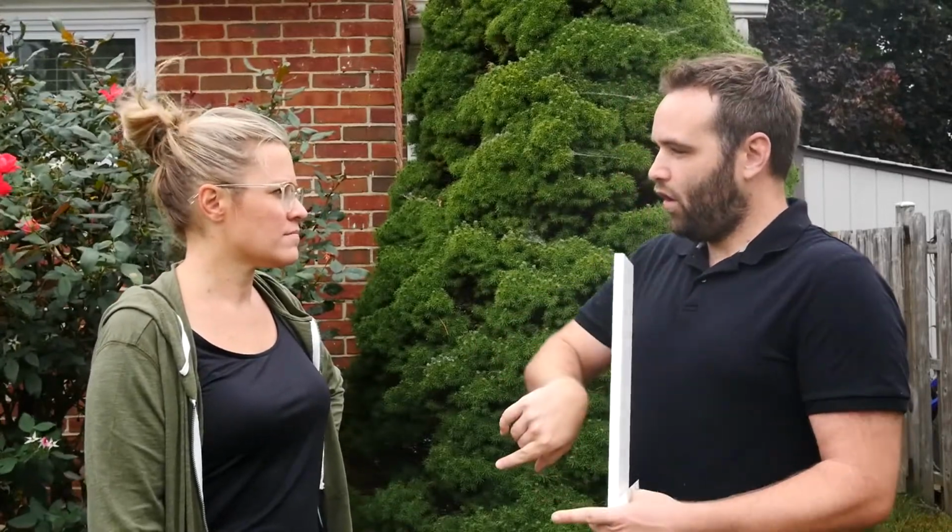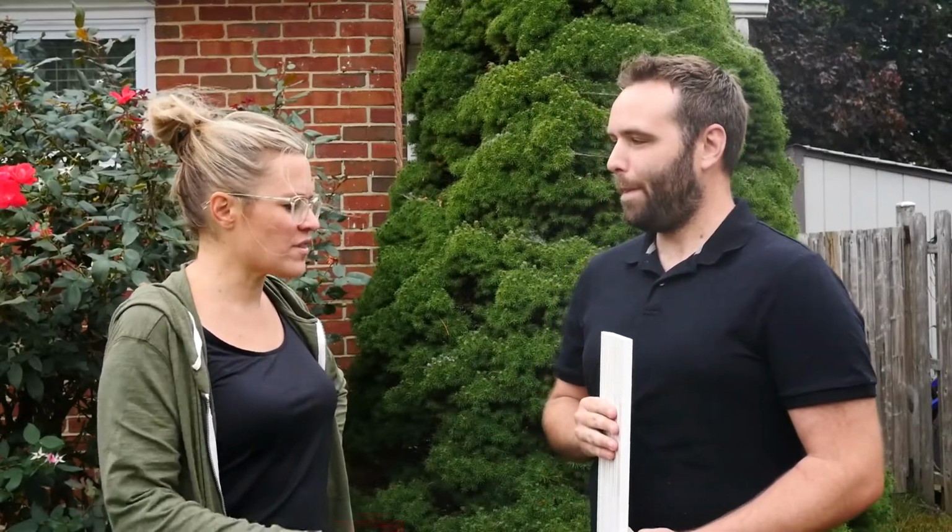And so do you also put, I know some people put construction adhesive on the back. What's your personal preference when it comes to that? You don't have to, unless there's an instance where it could be a pocket door, there could be something behind the wall where you can't necessarily nail. You would put a bead of construction adhesive behind there, and you can use a reduced depth nail and angle into the drywall, and that kind of holds a bit, just so the construction adhesive can set up. But what size 16 gauge nail do you use? We're going to use a 2-inch on this one. Okay, great. And then what's the next step after this? After you've got all your trim nailed up?